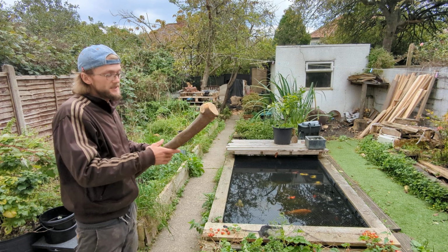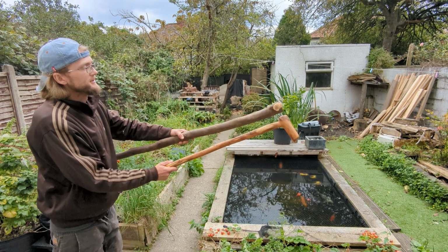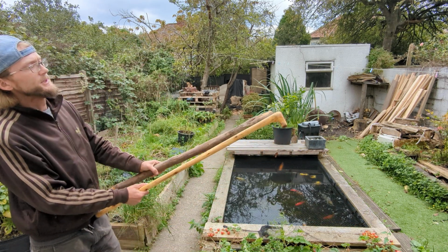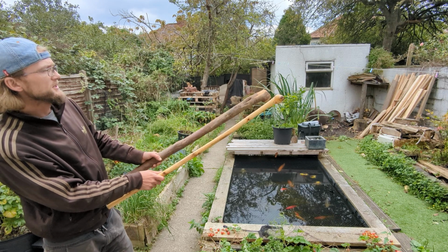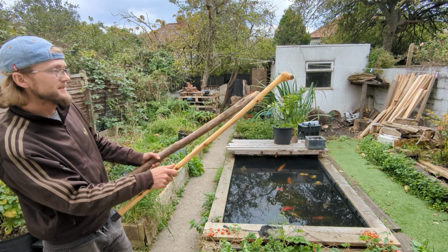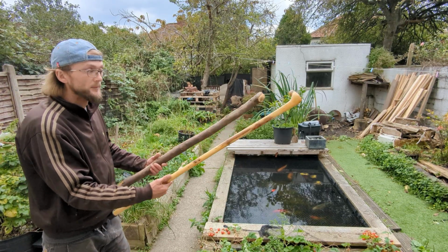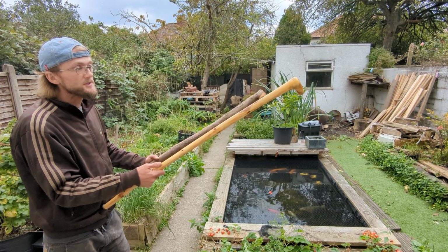The draw knife and the rasp do very well. And once you've got past the rasping stage, let's bring out one of these sticks for comparison. Let's bring this guy up. It's probably a closer comparison. Once you pass the rasping stage, you should be more or less at this point. Then it's a case of trying to get rid of your tooling marks. Then you move to your 60 grit sandpapers, remembering that you're going to lose strength.